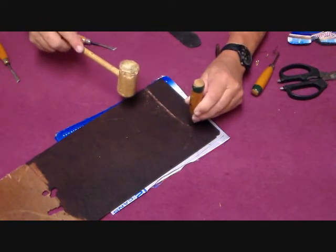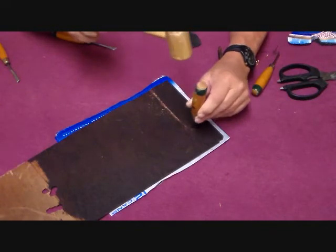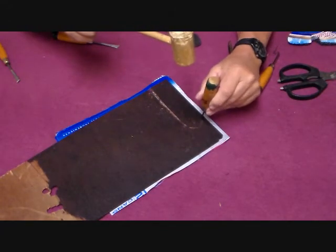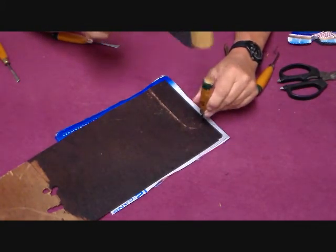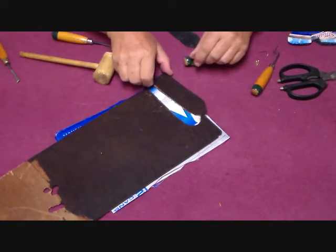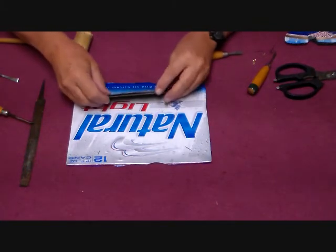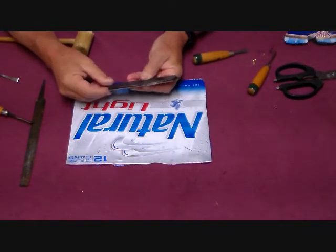This edge is opening, and the only thing retaining it is here at the tip, which we're working on right now. This plywood is actually more difficult to work than a solid piece of wood because it splits so badly. Now we're free — we have the wooden piece removed. You notice this ragged edge right here. So we're going to start working this down with files and rasp. A half round bastard — that's what it's really called — and so we're going to start working and smoothing this edge down until we can get it to actually fit.